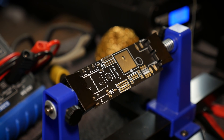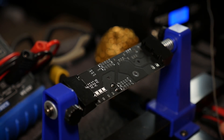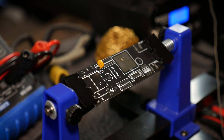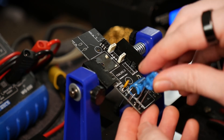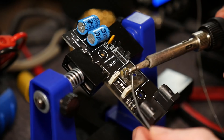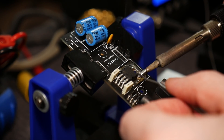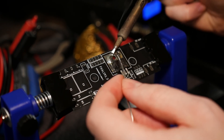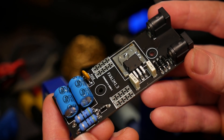The supply boards is where the complexity lies. As power comes into the board it first hits a resettable thermal fuse which will disconnect the supply if the pedals ever start drawing too much current. After a period of cool down the power supply will operate normally again. Another diode protects against polarity inversion if you assemble the supply boards the wrong way round. A pair of electrolytic capacitors and the resistors from the voltage kit form a filtering circuit, further stabilising and cleaning the power and doing a little bit of voltage reduction. Next comes the voltage regulator of choice for the output voltage you require. This will provide a stable, consistent voltage regardless of the current draw of the device. It does need to dissipate additional energy as heat in this process so is soldered to a wide pad on the board to act as a heatsink. This uses voltage regulators and some carefully designed filtering to keep the power as clean as possible and prevent any fluctuations in the power line introduced by digital pedals which can often cause noise.